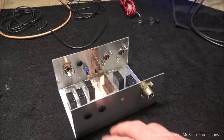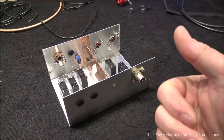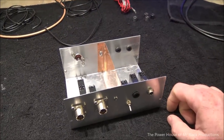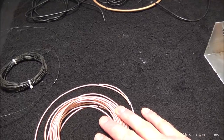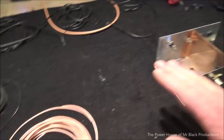functions over here. We're getting into the output port jacks for the radios. Make sense? RF isolation. Kill two birds with one stone. So we're going to use 316 mini coax, which will more than adequately carry the couple hundred watts worth of power that we're going to run through this thing. Two at the most, maybe probably 100 is what he's going to run through this box.